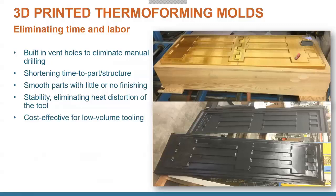If you are trying to do tens of thousands of molds, this works great as a bridge to production. If you have to wait two months for your metal tooling to get made, you can 3D print the mold, get it set up and running within a week, start doing your runs, and then when the actual metal tooling arrives, replace it and get up and running much faster — eliminating downtime while waiting for the part to be made.